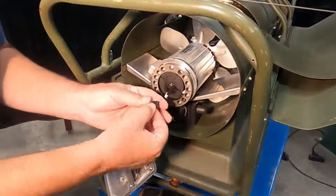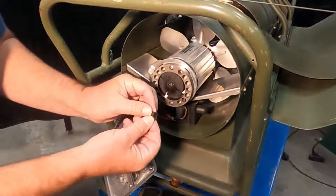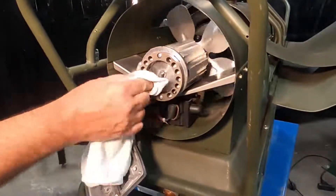Check the rotor and ensure it is not damaged. Check rotor blades and ensure that they are not sticking, worn, or broken. Remove rotor and blades and inspect the pump body for deep grooves or gouges. Wipe out the pump body with a soft cloth.